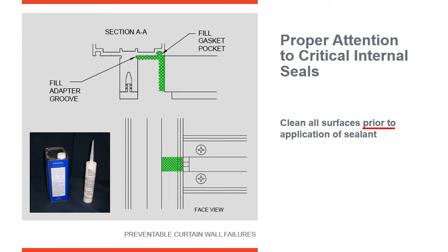When you start going through the installation instructions for a curtain wall system, you're going to see lots of places where silicone is required. No metal-to-metal joint is waterproof, no matter how square cut they are, no matter how tightly they're fastened. They're not waterproof, they're not airtight — they all have to be sealed. Within the installation instructions, sealing joints is going to be called out wherever there's metal-to-metal contact.